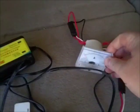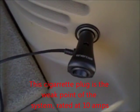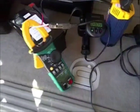I put an amp meter on the output of the battery charger just to see what rate I'm charging at. It's connected via a standard cigarette lighter plug into the power outlet in the back of my truck. My outlet is rated for 20 amps, but obviously check your vehicle — if you've got a 10 or 15 amp fuse you don't want to go too high on amperage. At 3 amps it's not bad — it's a faster charge rate than some 1-amp models like the Battery Minder or Battery Tender Junior.